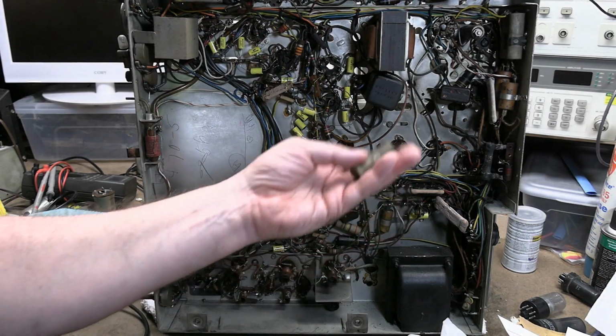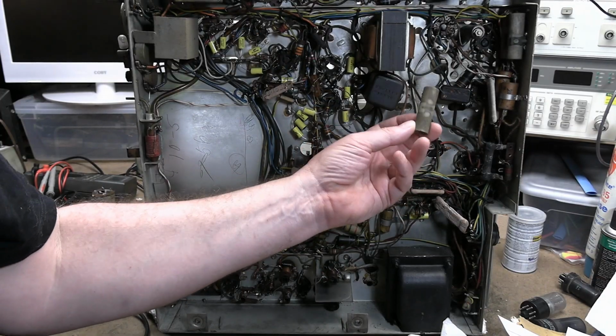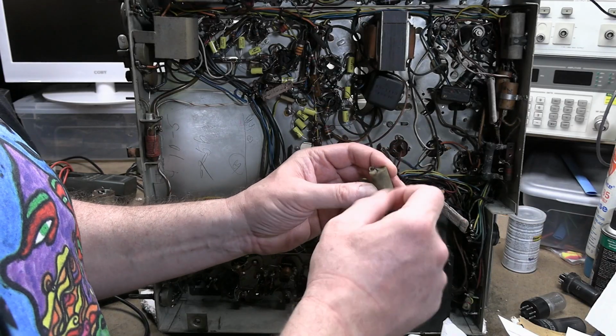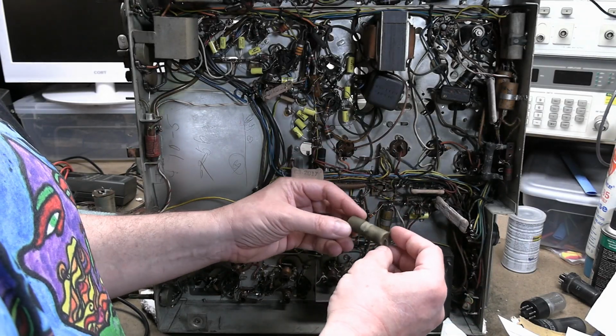So they get hammered with some pulses. You want to use high quality, high reliability caps for these. These might be oil impregnated. They're in a type of ceramic, very hard plasticky type of cap. They remind me of Duramold caps.